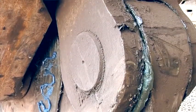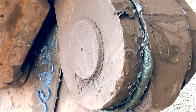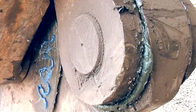But tell me about the seal. What are you talking about when you're talking about a seal when it comes to grease? When you grease the piece of equipment, it both lubricates and pushes out to the outside of the component so that it creates a seal, keeping that water and contaminant ingress away.